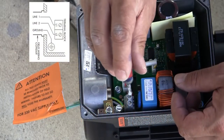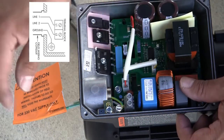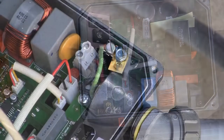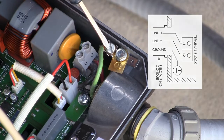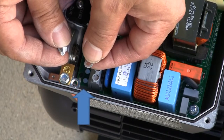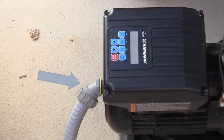Next, remove the three wires that serve as test leads for factory performance testing. They are connected to terminals L1, L2, and ground. These leads are not to be used to connect load power to the pump. Next, connect the 230 volt AC line power supply wiring to the terminal block and ground wire to the ground screws as shown in the input power wiring diagram in the manual. Make sure to utilize a watertight conduit connection to the pump's drive to ensure no water gets into the pump's drive or motor.